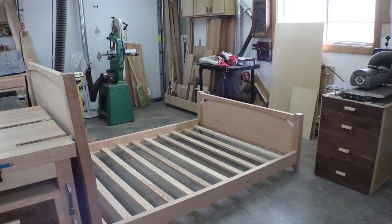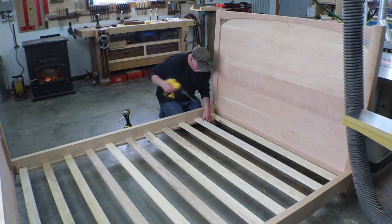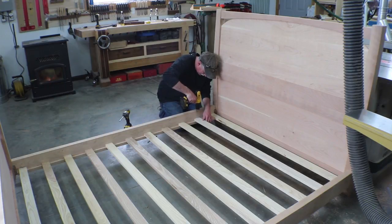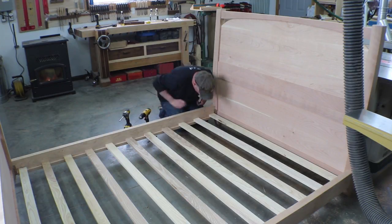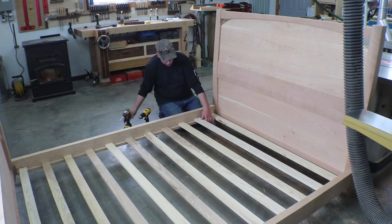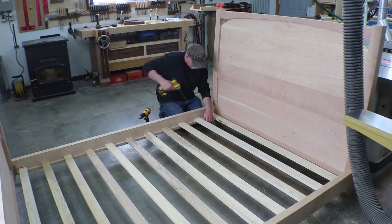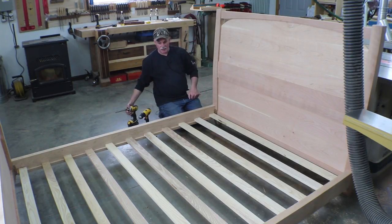The slats are all just set in. Next up we've got to drill and countersink them and get our pilots in those rails. When I pull it apart for finish, that's when I'll go ahead and put some screws in those slat supports as well. I cut a 5-inch block that I'm using as my spacer, setting it in and pilot drilling into the slat support. And again, I'm driving just temporary screws here, because I have replacement screws for these. Rinse and repeat until they're all in.